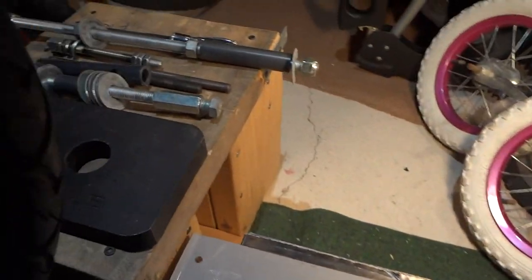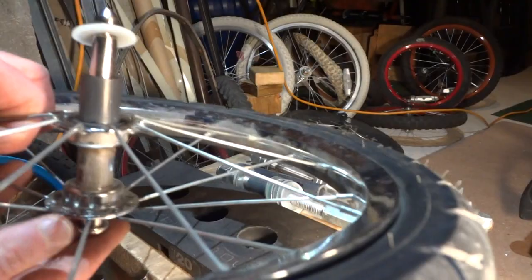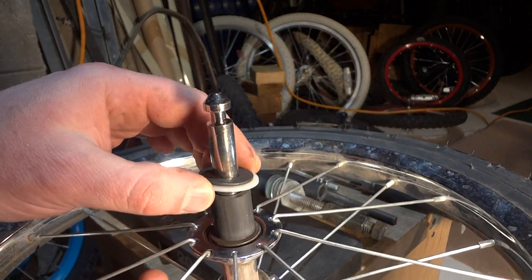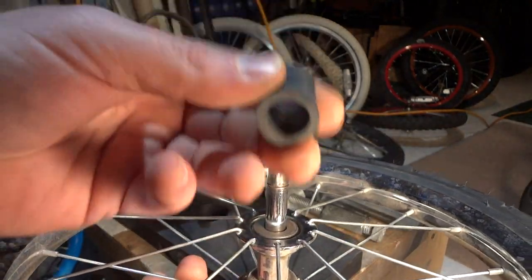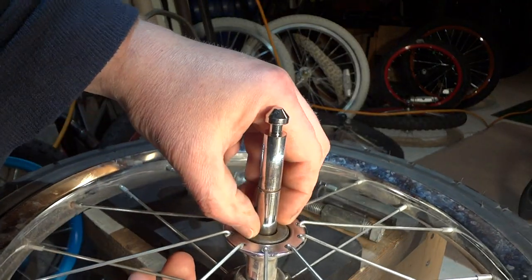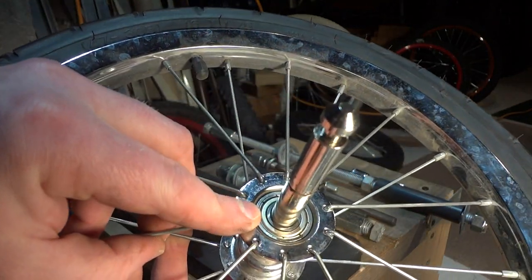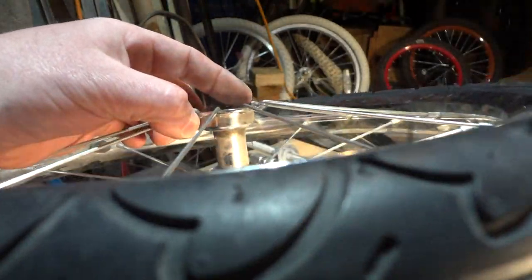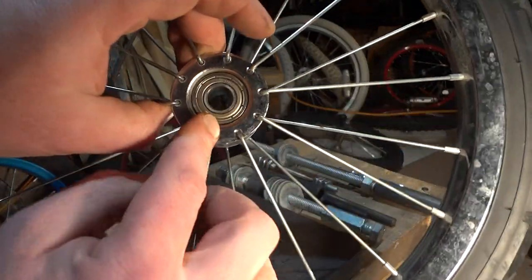So I'm just doing a mock-up here, like a test fit. I've got a metal washer right here, and you can add another one if there's not enough space. Cut your spacer to a proper size so it fits perfectly on the shaft — this one is almost perfect. Then I have another washer on the other side. What I'm trying to do is prevent that bearing, which I stuck inside there, from working its way out, because they're not very tightly pressed in. You can see the bearing just falls right out.